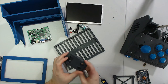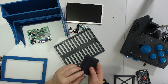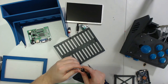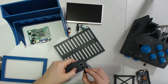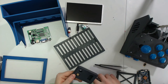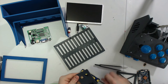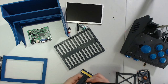If you're replicating the same electronics that I'm doing, we can go ahead and mount up our power jack and our power switch. Take the nut off of the power jack — it's designed to go into the larger hole on the bottom. What works best is if you can get it positioned properly, hold it with something to get it started, and then spin the piece from the other side.